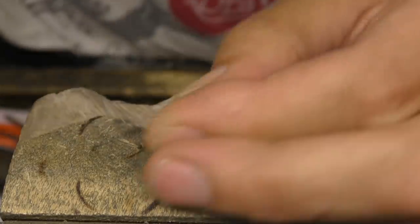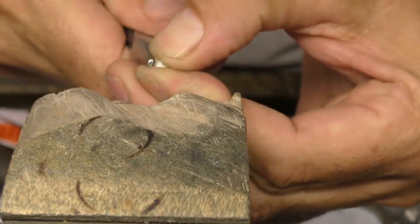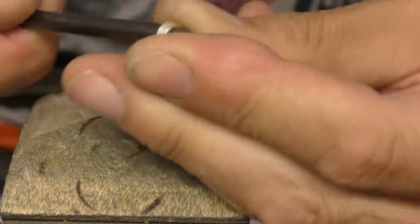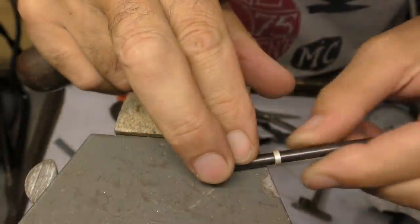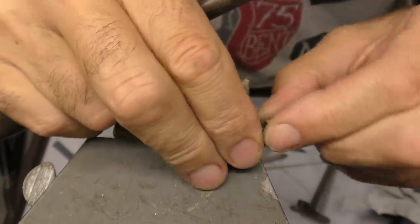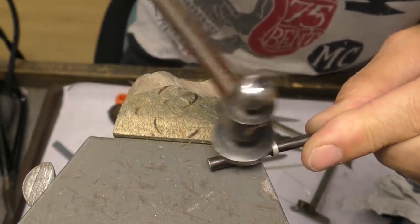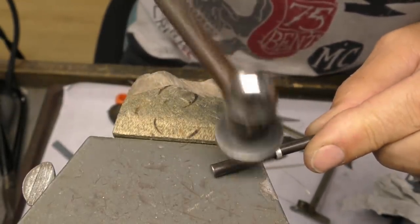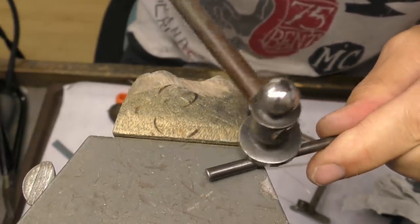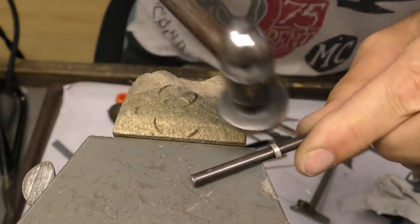Now you can use any stake that fits inside. So I've just got one of my doming punches that I'll use. If the stake you're using is a bit smaller than that and it's running quite free, it doesn't really matter. It'll still work. So just tap around, move the stake around as you go, and you'll be making this into a perfect round